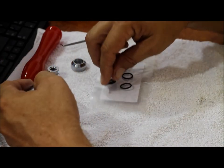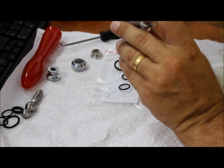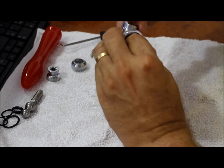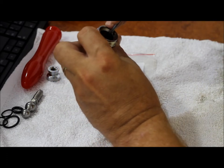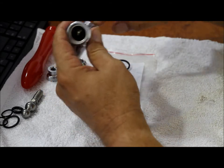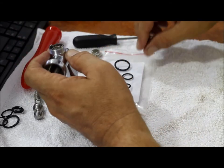The first one we need to put in place is the main forward seal. Apply just a tiny little bit of lube — not too much, you don't want dags of the stuff hanging off there. Put your finger down inside and guide it into place if you need to using a little probe tool. Just pop it down inside there and drop it into place behind the two retainers. Make sure it's seated — pop your handle back in and give it a little poke around to be sure.